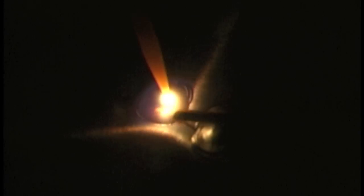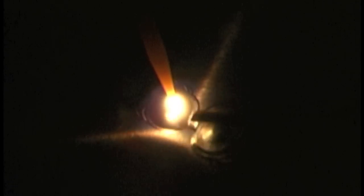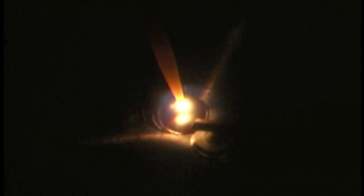When you're pulsing like this, generally without pulse you need about one amp per thousand, so I would only need 32 amps here. But when you're pulsing like this and you have a pretty low background rate, you sometimes have to set the amperage to about twice.